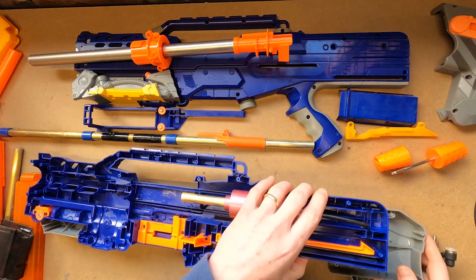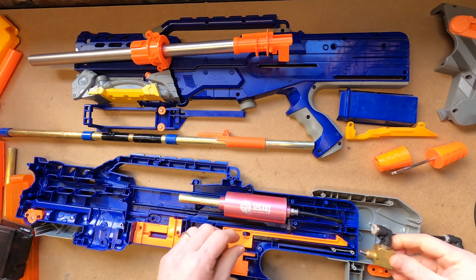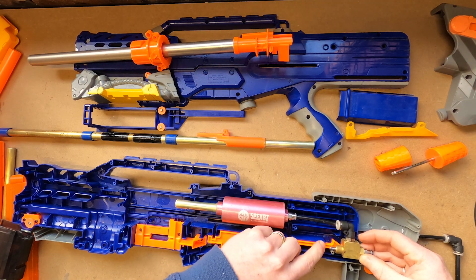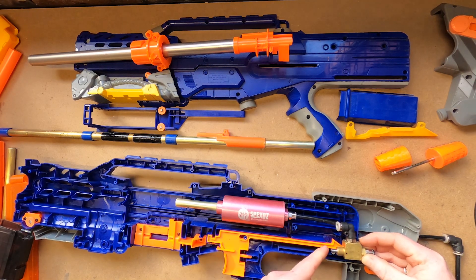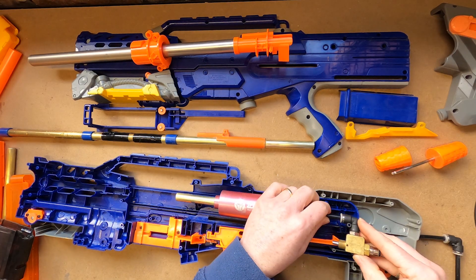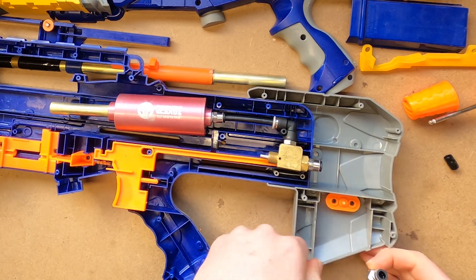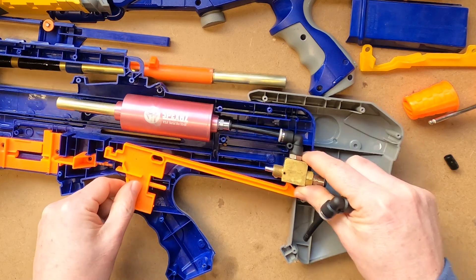At the back, inside the stock piece, I'll have the MJVO3 valve fitted right at the back of the trigger, just about like this. The trigger will activate the valve button directly, and the valve will be held in place just by cutting space for it inside the back of the shell on both sides. Further at the back, I'll have my remote line inlet connectors attached somewhere like this, and that will feed into the MJVO3 valve inlet so that air goes out the right way.